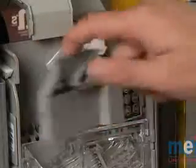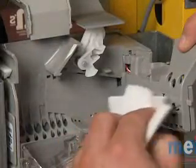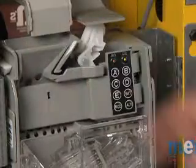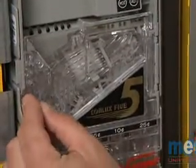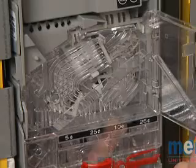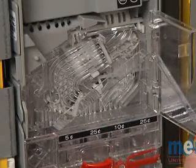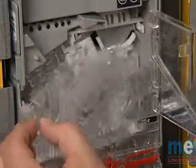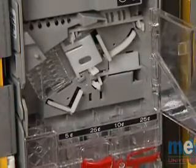On the discriminator portion of the coin changer, clean the coin rails, coin paths, and gates. To gain access to the gates, first open the coin chute cover by pushing on the clip and swinging the cover to the right. Next, remove the coin chute by pushing the clip to the right and pulling the chute forward.